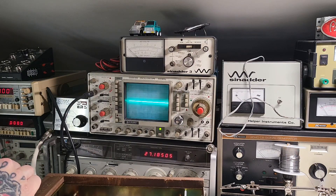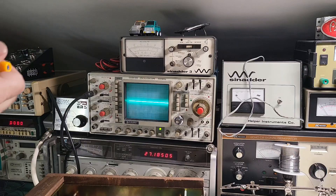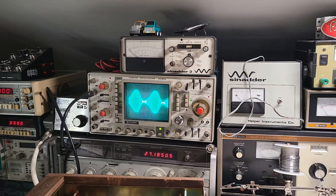That's what you're shooting for — adjust for max without distortion. Move the VRs to the maximum, both of them, without having anything look distorted. It's that simple, that's how I do it. Let me go back and adjust the VRs. That's basically it — that's all there is to adjusting these speech compression boards.